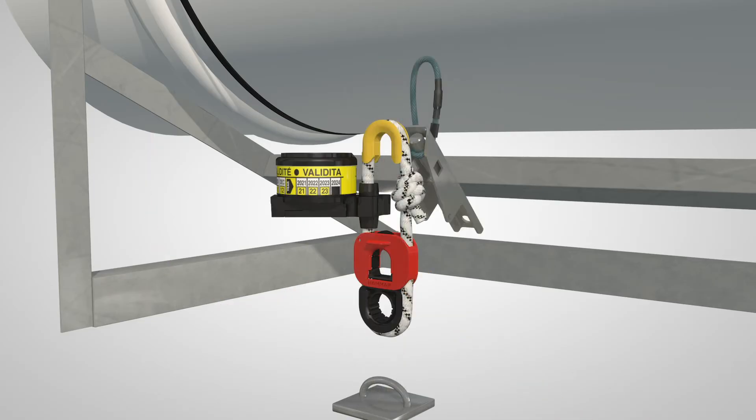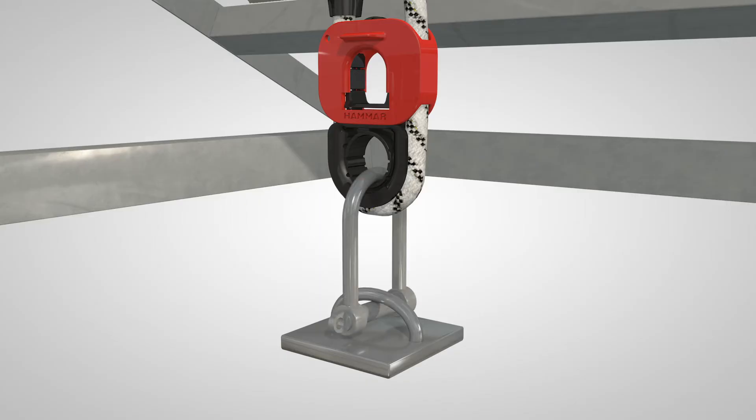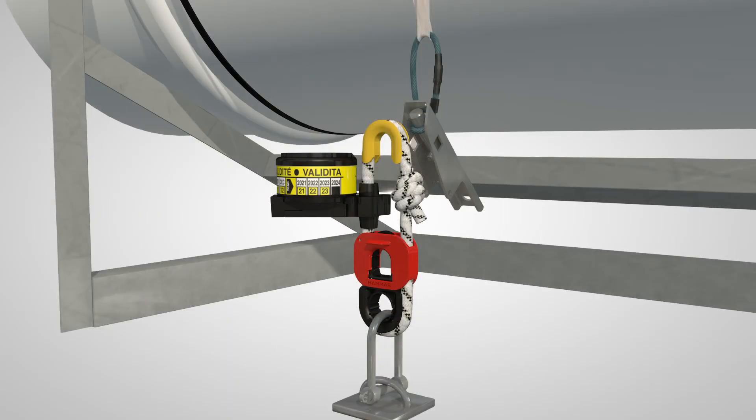To install, along with an H20 HRU, connect the H20 strong rope to a strong point on the deck or life raft cradle with a shackle. Connect the life raft lashing to the EZRelease wire loop and adjust so the lever will reach the strong rope.